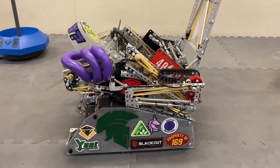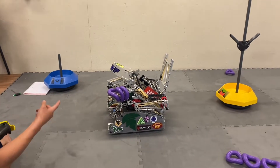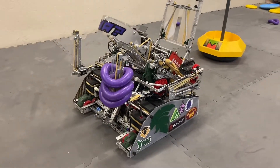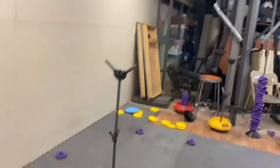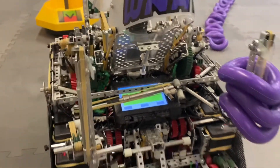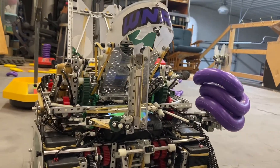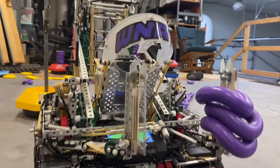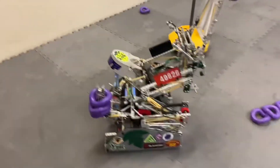This all unfolds by opening up the back baselift — as soon as I open it up, the ring mech opens up, and then we can deploy the fingers back by locking them. The one more thing this does: we have to load that left side of the robot, and that's done with this piston in the back, which swings in the finger there underneath the ring mech. That allows us to pick up rings in the front just like we would with a normal goal, except it then deploys them onto the finger and along this line of rings.